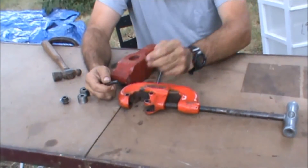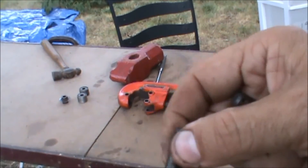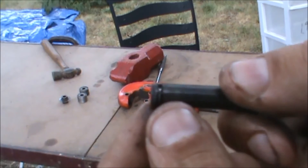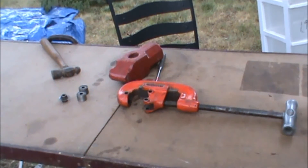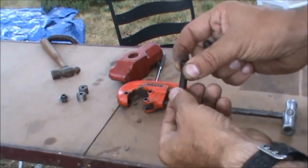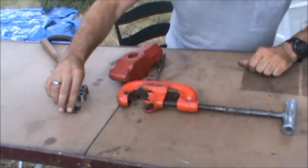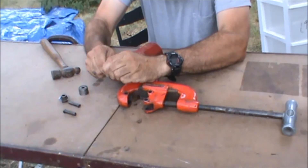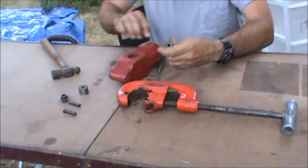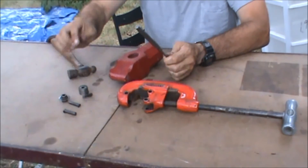I'm going to take a look at all these pins to make sure they're not bent. Here's the little T-head that fits in that slot, and on here is a little baby snap ring — make sure that that is in place. You want to look at all three of those, make sure they're not bent. If you're ordering parts from Ridgid, you may want to order some of these ahead of time — they're not very expensive. You might want to test fit those in there and make sure they fit really well. They should be pretty tight.